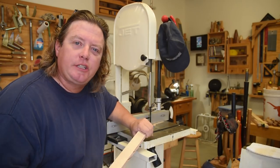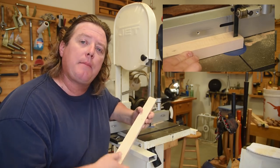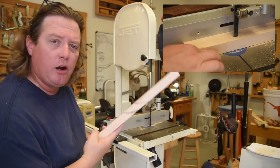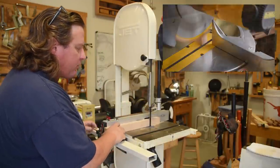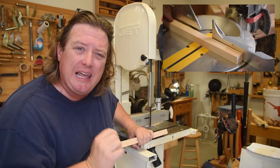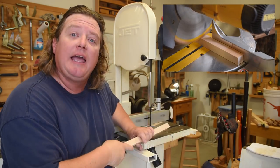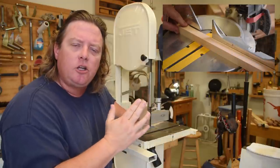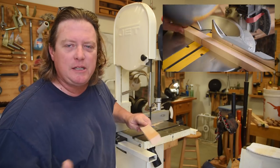The material we're going to be using for this first icicle is a piece of curly maple. And when I'm in my shop, I basically keep my bandsaw set up so it's nice and square, so I can grab a piece of scrap, come over, set it to its width, and cut me out squares. And having squares is really important with the type of jaws we are using on our chuck. It is also important to have it nice and 90 degrees on end, so I cut them to length on my chop saw to make sure that's going to be safe.